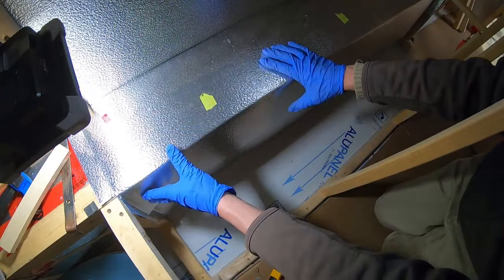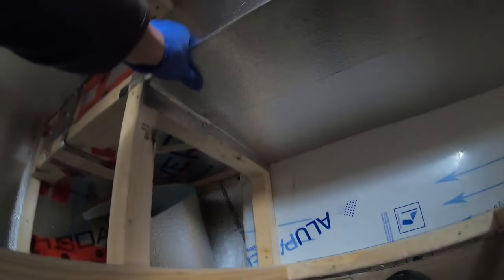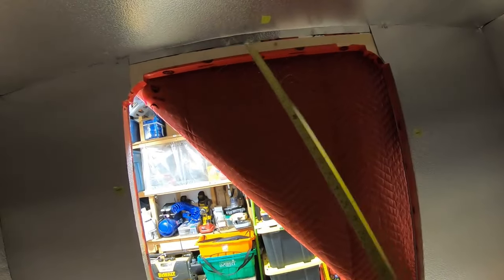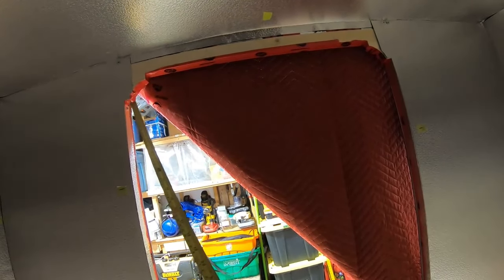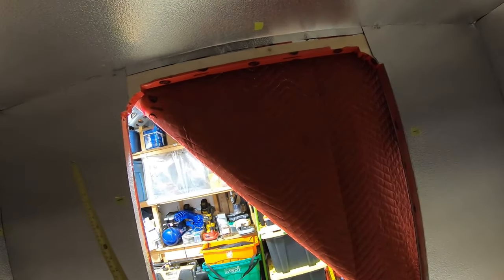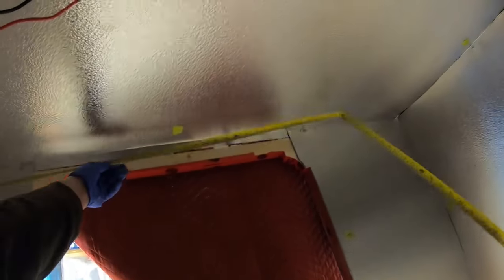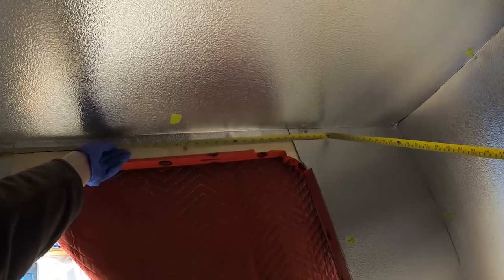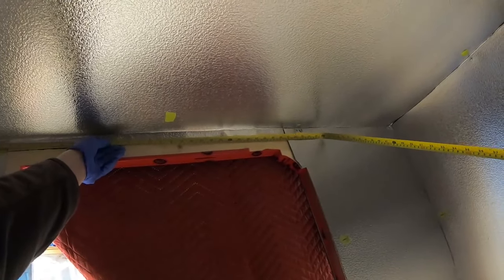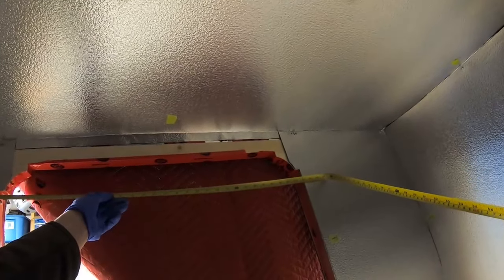I still need to do a little bit of modification up right here - boy, wasn't that a pain to get in. Actually, getting it under was fine; adjusting this corner was a real pain. For this section up here I'm going to come down as far as this, so it has to be at least that wide. The narrowest piece I have in scrap is six inches and that's five - that should be fine. 34 inches at the break right there, and that'll come down there. Yep, 34 inches - should work.